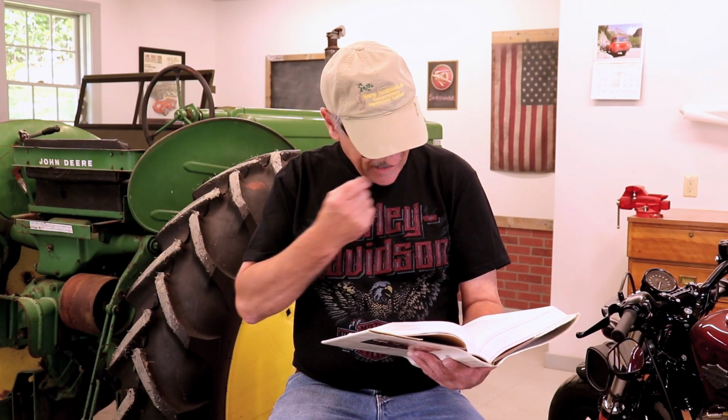and it was rated at 14.39 horsepower, and that 14 horse was at the drawbar, and it incorporated what Brohill talks about as an integral system or hydraulic system, which they call the touch-o-matic, which was a way of attaching the equipment. And you were able to control that equipment by two levers that were in front of the seat between your knees. And everything from the mowing machine to the plow, all of it was integrated into the machine itself. So all that equipment had to be bought specifically for the M and the MT tractor.